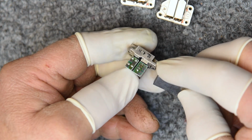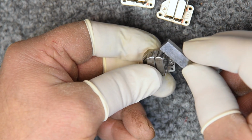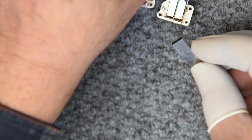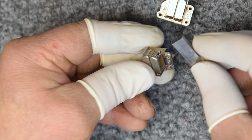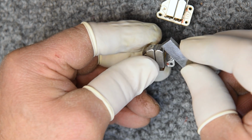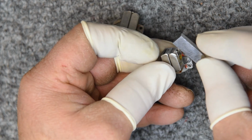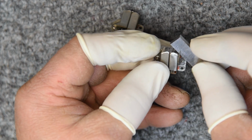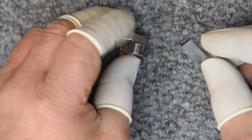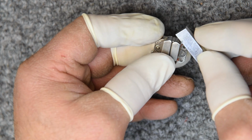Here's another brand new head, a different batch. Again, exactly the same way, tiny bit of wiggle. This is one of the heads, and the gauge can't go in there. This is the other head with the bent guides, and the gauge does go in there. So there's a 50% chance on these two of hitting it. Now that's out of spec.